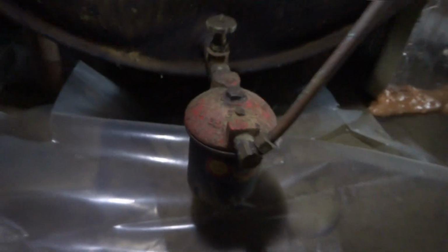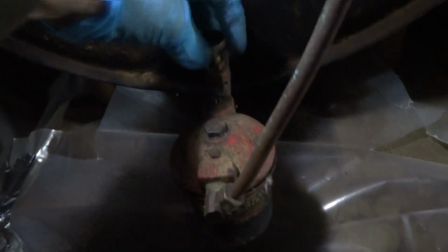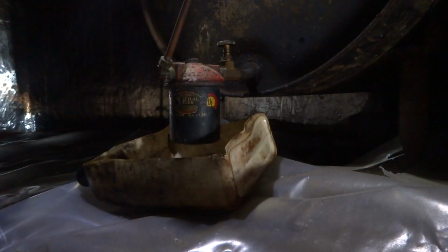Down underneath where the boiler is, got all the circulators down here. That big pipe, 1.5 inches. Come on. 3, 6, 7 of them. I did check the feeder. Feeder's okay. I think I gotta change this filter. No power down here, so I don't know. Don't look like that's been changed in a long time. Probably really bad. She's a crusty one, Mr. Grinch.